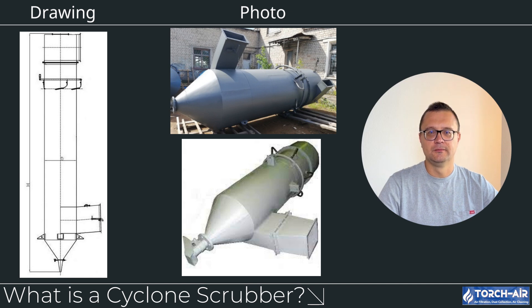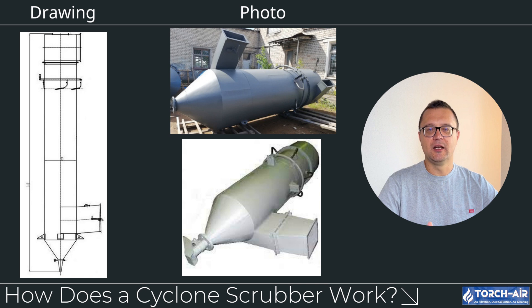What is a Cyclone Scrubber? A Cyclone Scrubber is a hybrid air pollution control device that combines the principles of a Cyclone Separator with a wet scrubber. These systems are used to remove particulates, mists, and gaseous pollutants from industrial exhaust streams. They use a combination of centrifugal force and a scrubbing liquid to capture and remove contaminants, making them ideal for industries dealing with mixed-phase pollution, like dust and gases at the same time. In simple terms, Cyclone Scrubbers spin the dirty airstream really fast, forcing heavy particles to the outer edge where they can be captured, while a liquid is sprayed in to capture finer particulates and gases, giving you a cleaner exhaust on the other side.